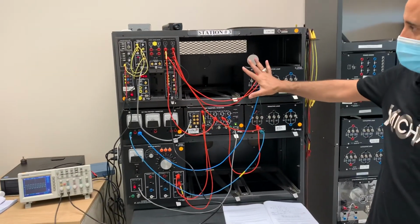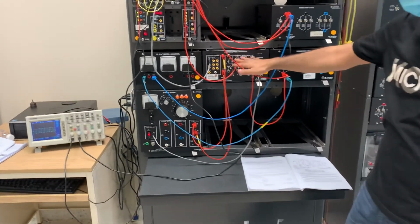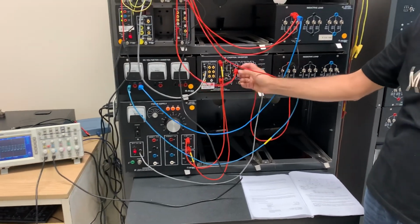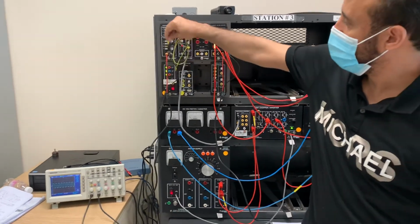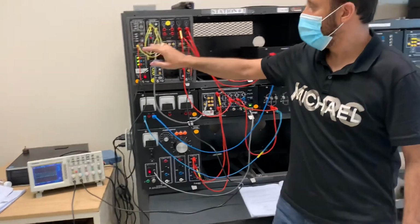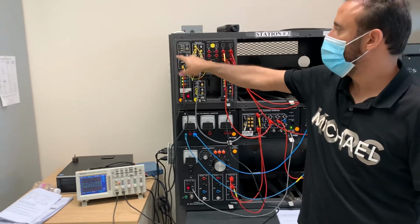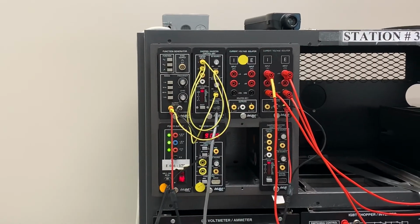Okay, this is an IGBT right here, and we have 4 IGBTs, and this is our load. This is the basic connection. Make sure you do the connection. We close the switch, and this time we apply the function generator, guys. We choose the pulse width modulation right here, and we apply a sinusoidal wave in the function generator, and we have pulse width modulation.